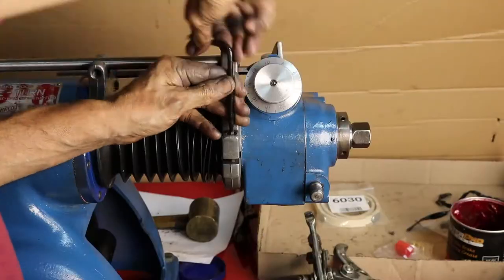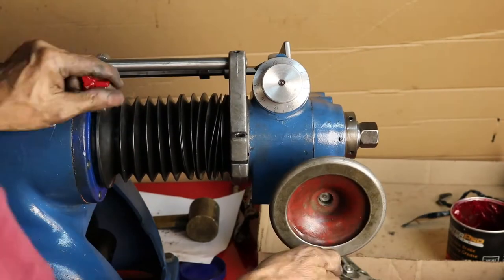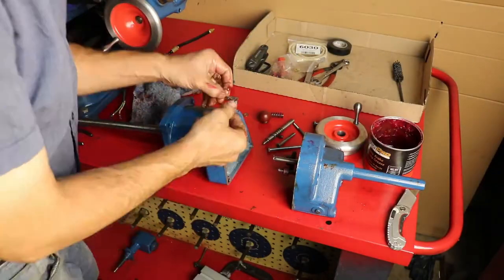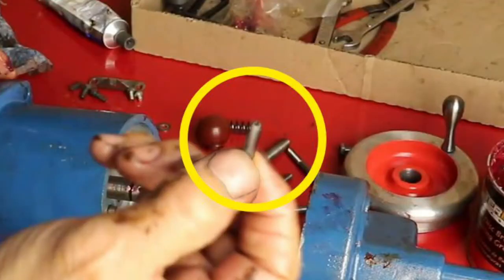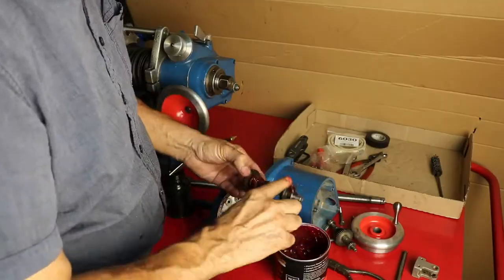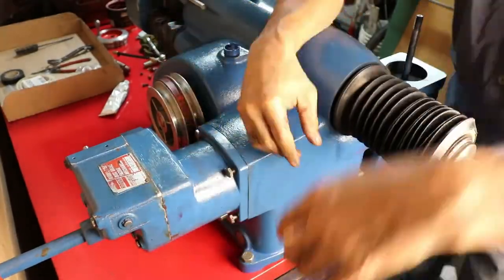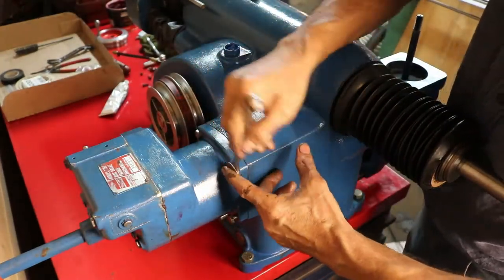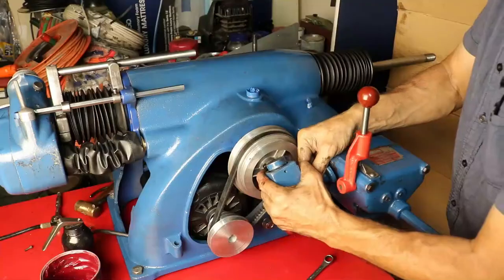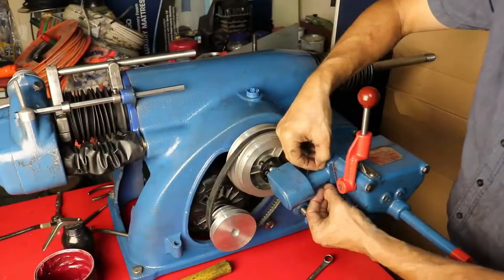Don't forget the lead screw nut — now it's better. Finally, the reel clamps and the lock rod. This brake-fit mechanism gearbox is not as complicated as the other one, but it does require some patience to assemble as well. A roll pin holds both halves together, so it's a little tricky to remove and install to separate the halves. After applying Permatex and greasing the gears, it's finally together. The assembly goes back into the mainframe. The drive housing is installed — first the pulley drive, then to install the housing, you have to loosen the belt pulley and move it inwards to position the housing, then bolt it down and move the pulley back to its place. Line up the motor pulley after.